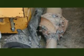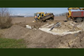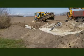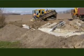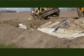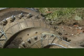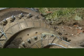Roads are crossed by means of controlled directional drillings. It is important to know in advance how deep the directional drilling will be, as this affects the heat dissipation of the cables. In some cases, a total of 3 pipes have been included in a directional drilling, laid in a close triangular formation. In other cases, primarily in connection with very long or deep directional drillings, each directional drilling has involved only 1 pipe, with the pipes being laid with a spacing of approximately 1 metre.